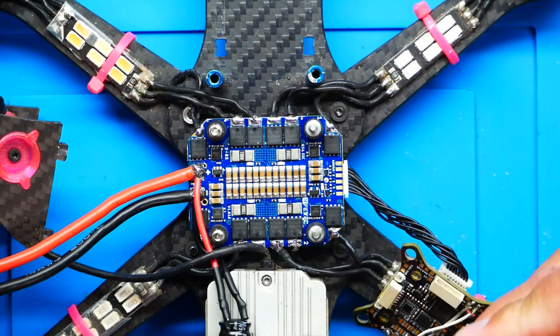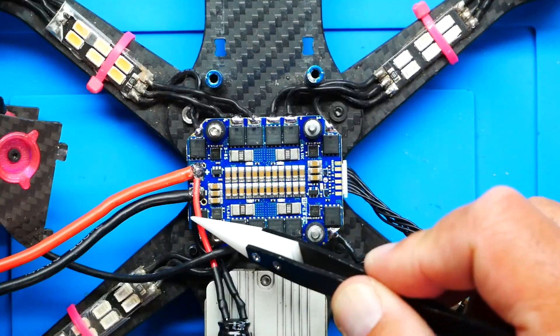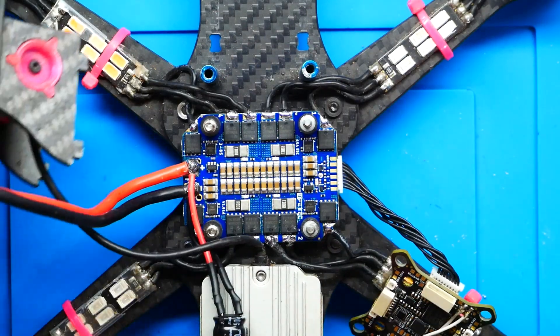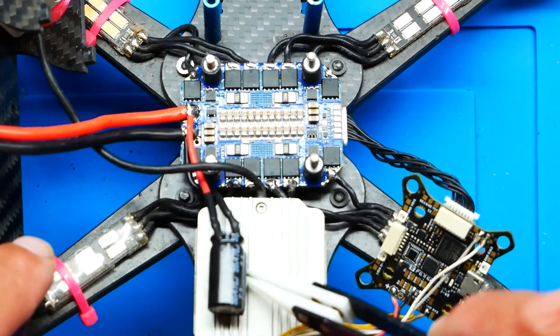The reason I bring this up is because of my capacitor. You want your capacitor to be soldered directly to your ESC, even if it does look a little silly or hang out just a bit. You're going to get the most out of your capacitor if you solder it directly — positive, negative, done. I didn't have that luxury because I'm already protruding quite a bit, so I ran my capacitor over here and it's going to be held on by my top plate, with a little bit of double-sided sticky tape underneath holding it in place.